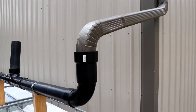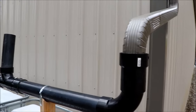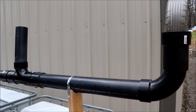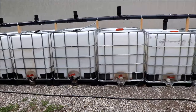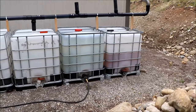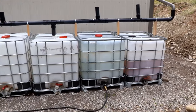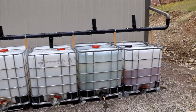We couldn't quite match the original building color, but for here it doesn't really matter. We're going to bring the pipe from the south side along the building, drop it in, and add a Y with a reducer down to three inches to collect water from the south side. The totes are food grade and I'd recommend that — some cheap totes have had all kinds of chemicals in them and you don't want that in your rainwater, especially for your garden. What comes off the roof is a little dirty, so we try to get a bit of runoff into the first tank to flush out dust from the eaves trough, then collect in the remaining seven. We've got four totes of one size, one of another size, and three approximately the same size.